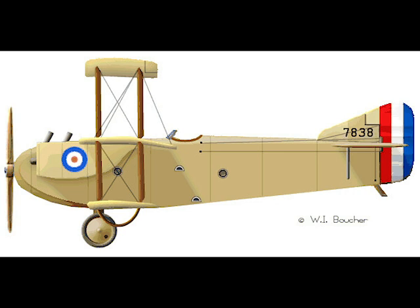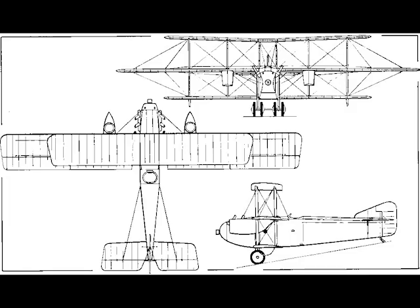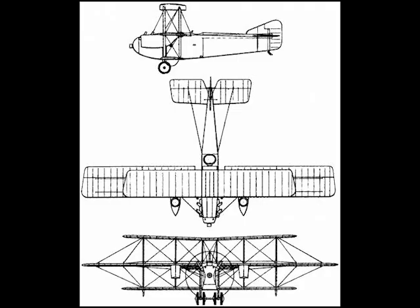Much larger than its predecessor, the revised triplane had a conventional fuselage filling the lower gap and rested in a normal tail-down attitude. The four undercarriage wheels were mounted in pairs on two substantial oleo legs. The main planes were similar in general disposition to the first triplane, still braced as a single-bay structure but with auxiliary interplane struts at mid-bay points. The gunners' nacelles were underslung from the central main plane. Flight tests were made by Peter Legh and Lieutenant R. Pays. Performance was disappointing, no one liked the aircraft, and by the time it appeared gun-synchronizing mechanisms had become available. Mercifully, the three-seat triplane was abandoned.